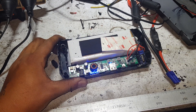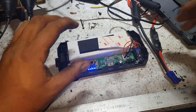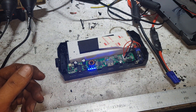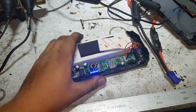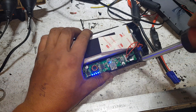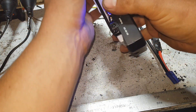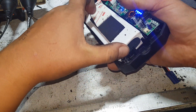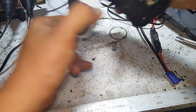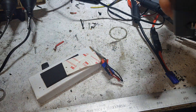Let's see if we can ID what's going on with the battery. As you can see the board's got four lights on so it must have been fully charged. We'll be a little bit careful because we really don't want to arc out a stainless steel ring across the terminal block down the bottom there. See if we can get it out. You'd assume it would have to be relatively well stuck in there because these would get dropped and stuff — protecting this battery would be by far the important part of its job.